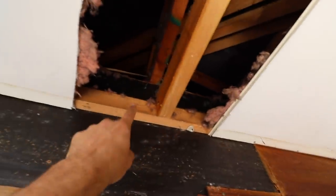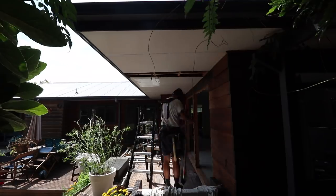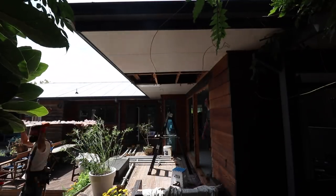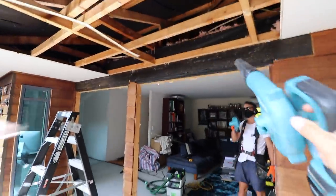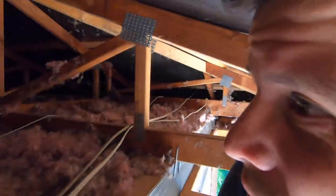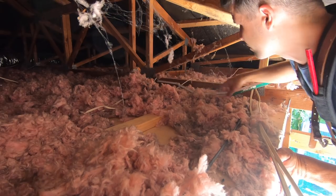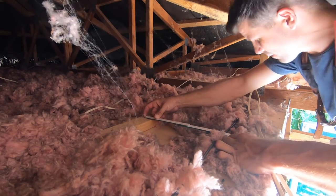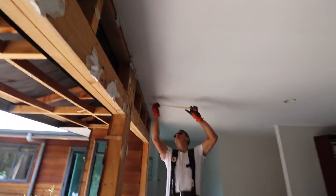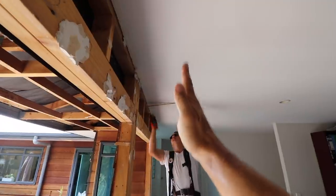And there's your frame — that's the part I was talking about that's nailed onto our frame that's coming out. So it's easier to see this side of the wall. The other side of the wall, in here — ceiling joist in there. 390 to the center. Would that be too close? Nice. So there we go — that same measurement from the underside. That's where we put our support.